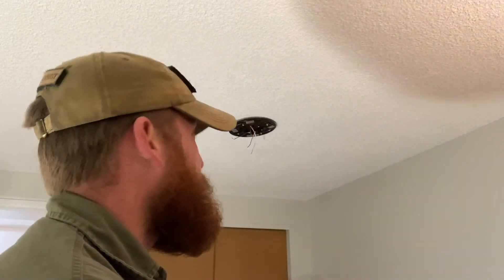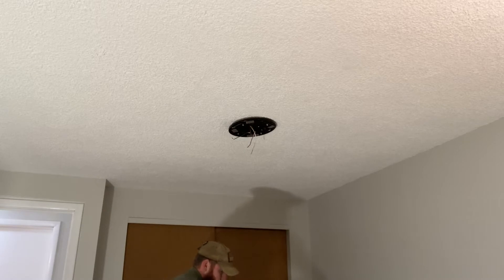The screw that they have for the box was a little bit too long because it used to run through the light fixture and into the box. Now that this is more of a flush mount, there's not enough thread space for that screw, so you can use drywall screws to secure these. I've used them a lot and they've never failed me, but use your own judgment. Also make sure your box is secure in the ceiling, because you don't want to attach something that was only held for a half-pound light fixture and then add a ceiling fan that weighs five or seven pounds — you don't want that crashing down in the middle of the night. So we'll double check to make sure the box is secure before we rent the place out.